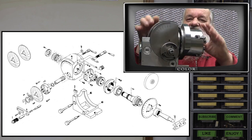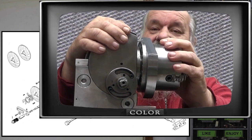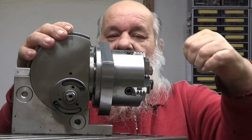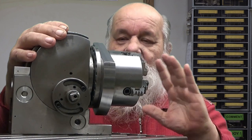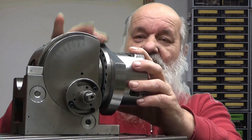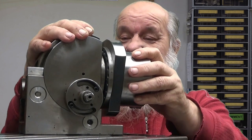what is this? It's a disc with pins. Well, it's a bearing there. Well, about the forces that this tolerates, it does not tolerate pulling this out from here. So if you are cutting in this direction, which is pulling your workpiece, you really should support it with the tailstock here. Yeah, this tiny bearing at the end doesn't like pulling too much. It's only for preloading the big bearing here. Pushing, instead, it tolerates like anything else. It can be pushed really hard, and well, that's okay.